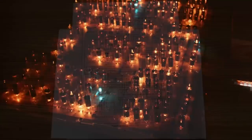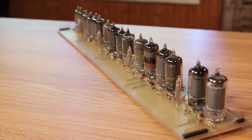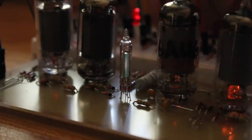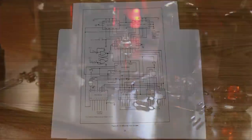We've already built the UE14500, and we already have 2 bytes of RAM on there. We can use 1 byte of RAM using our interesting vacuum tube and VFD combo to get our scratch register here in the center. That requires almost no modification whatsoever. So we already have 2 of our 7 blocks here taken care of.